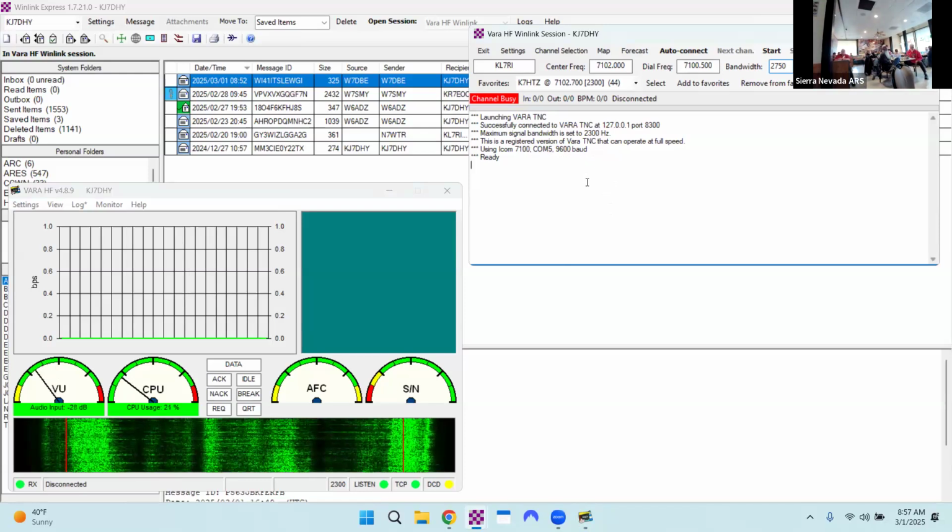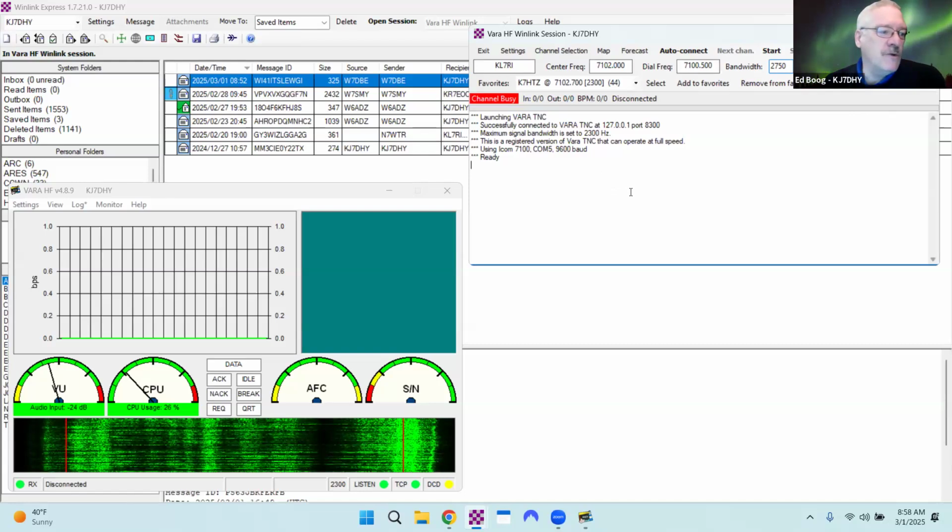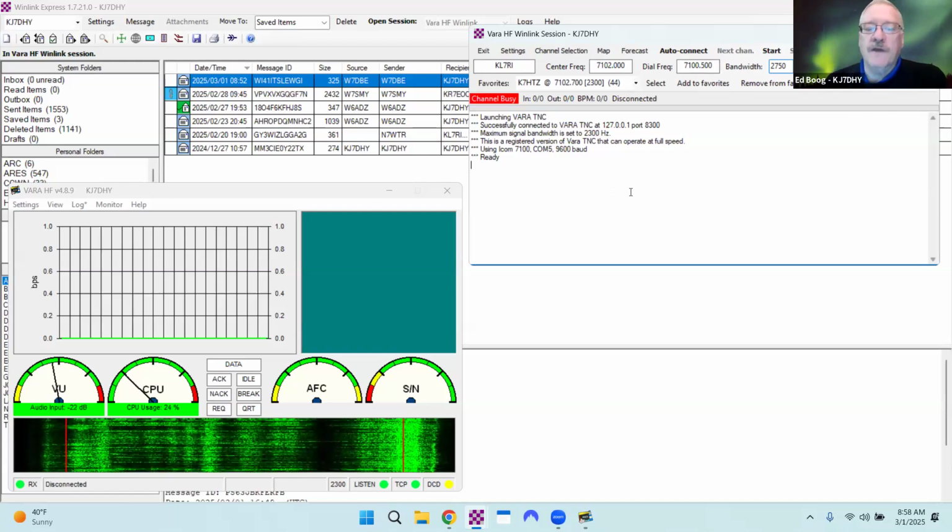And then just to be clear, Bill, that's the baud rate between your computer and your transmitter. We're not talking about going out on the air. We're talking about the handshaking. Right, the handshaking to the push to talk. Any questions on that before I ask the other question, Ed? Yeah, just as long as it's all the same. Your laptop, you want to have that baud rate. Your radio, you want to have that same baud rate. And then there's drivers that you want to have that same baud rate set in also, and it will start talking.